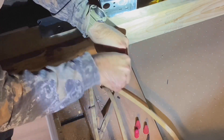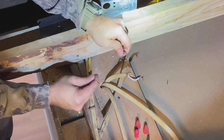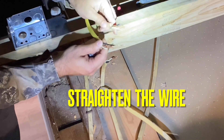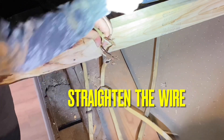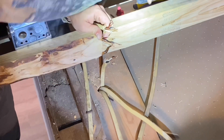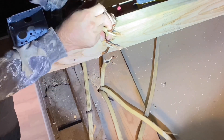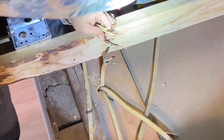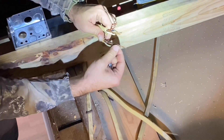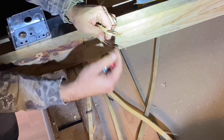Separate the wires. Now that you've got the wires separated, you can straighten them out. I use these pliers to straighten out the wires. If they're not already stripped and you're doing this for the first time, you're going to have to take a razor blade or some wire snippers to get those jackets off so that you can attach the wire nuts and twist them together.